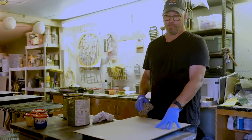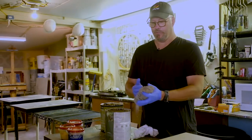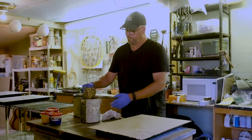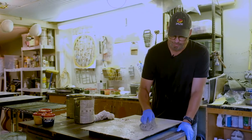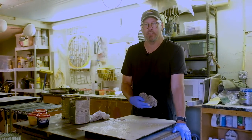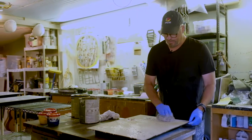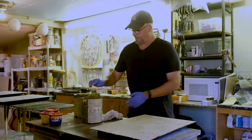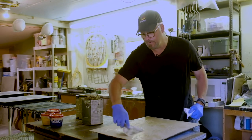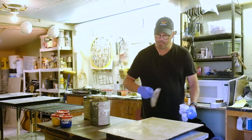This is a board that's had several skim coats on it — it's a very flat surface. What I try to do is give the piece texture, and it doesn't take a whole lot. I can use a sponge or a rag and just kind of put the texture on. That's a great thing about Venetian plaster — there's no wrong way of doing it. You can do anything: splatter, drizzle, different textures. I like to do this texture, and then just kind of do a knockdown. That gives deep areas that the skim coat can fill in as it smooths out the whole piece.